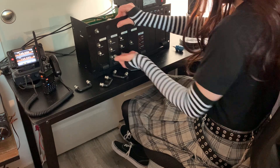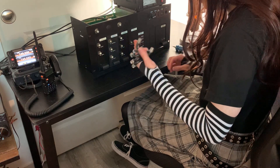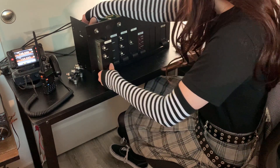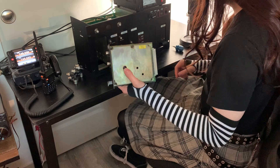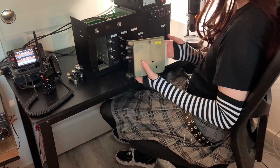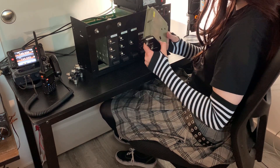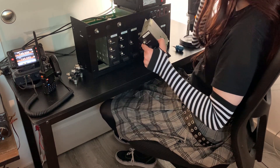I'm going to take a look at some of these modules here — they're a little stiff to take out, but they're probably two inches long and about an inch high. Okay, transmit synthesizer — not much to this. This is what they look like when they come out. Inside here is a ton of DIP switches; you need to change these DIP switches when you want to get yours on the ham band. By ham band I mean two meters — this is a VHF machine, and this is actually a VHF group one machine, so it just works on two meters.